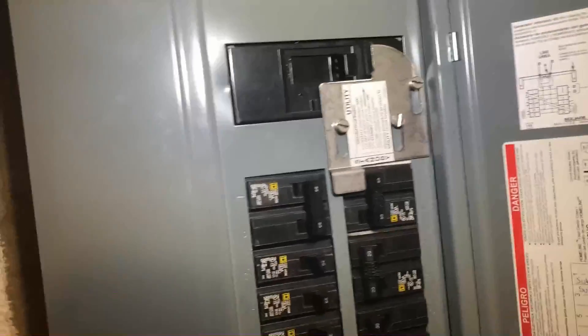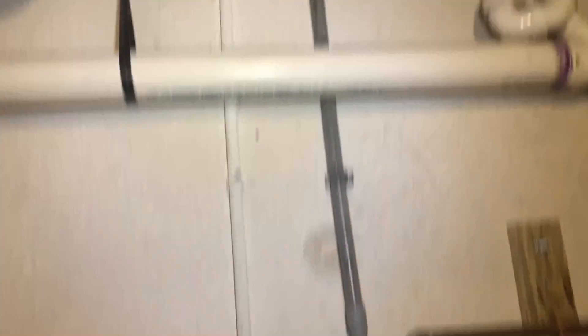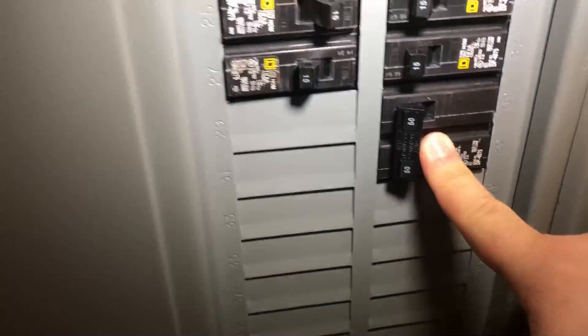That's the inside of the house. I also want to show you quickly that I wired in another conduit — you can see it goes up and out. This goes into my garage for a 50 amp, 240 volt service down here, so if I want to run a welder or something like that in the future I can. Let's go outside and check out that section.